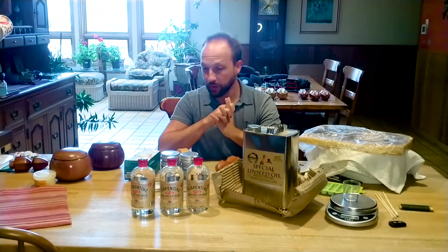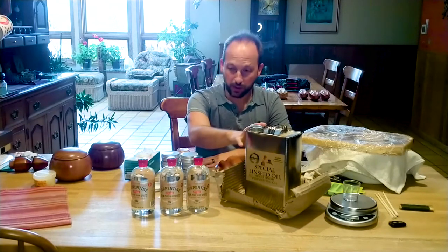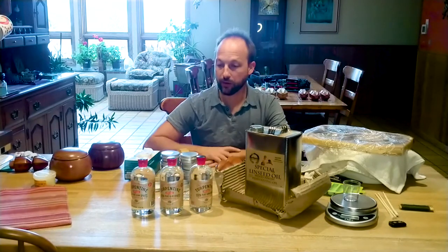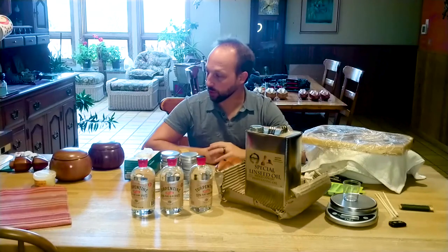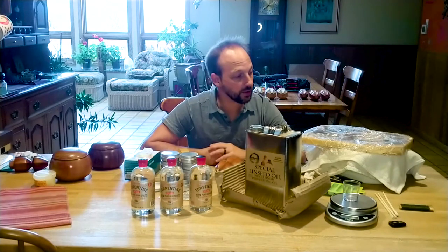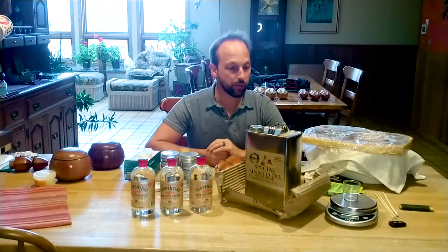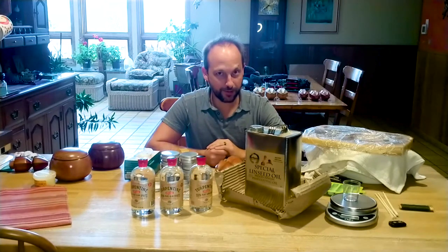I'd like to call it food safe. These things certainly aren't good for you to ingest, but once it's fully cured, linseed is perfectly safe. The turpentine, the gum spirits, will evaporate off once they've done their job, which is to make it softer and help it penetrate the wood. So once it's cured, this product should be safe to use for pretty much anything, any furniture, any cutting boards you have. It should smell really nice too, this local beeswax. So I'm pretty excited about this, and let's see how it goes.